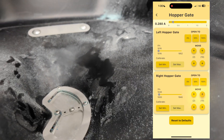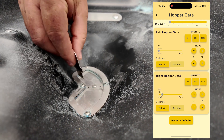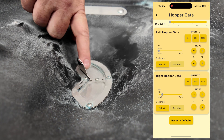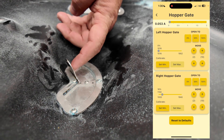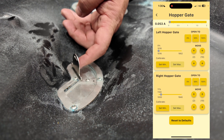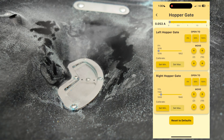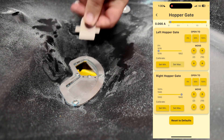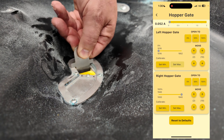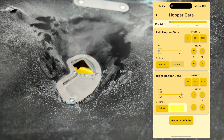I'll go to the other side. Start opening it up by hitting plus 10. I'll put my calibration key in, press very slightly forward, and hit minus 10. There's straight up and down, so that's set properly. I'll hit Set Min. Now I'll move it to 100%, turn it 90 degrees. It's already calibrated before so it's set perfectly. I'll hit Set Max.